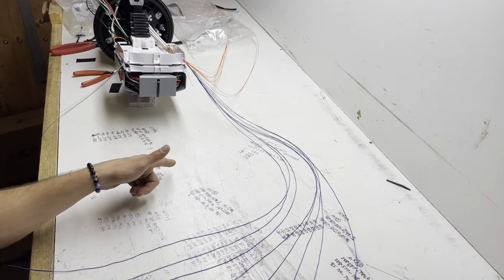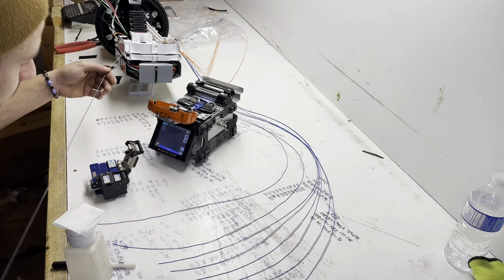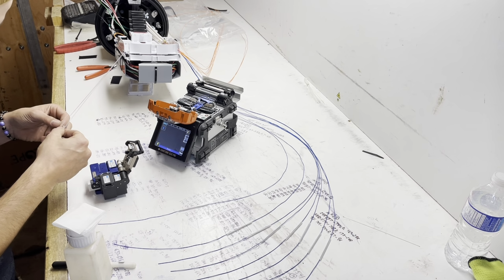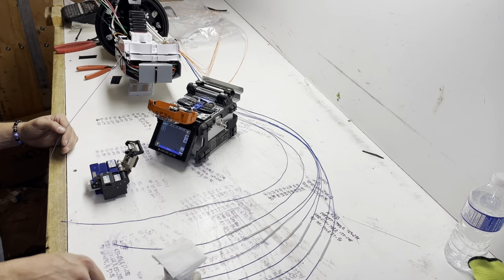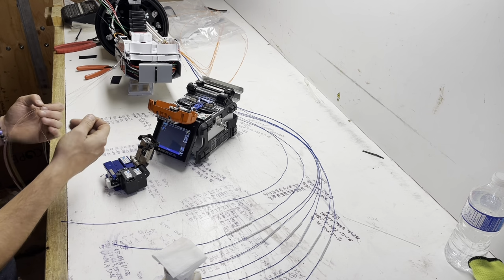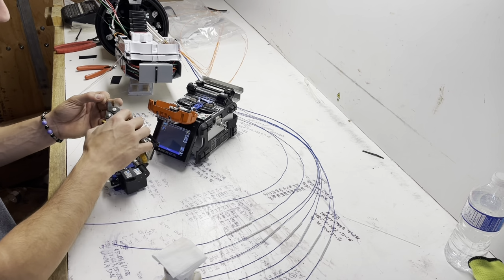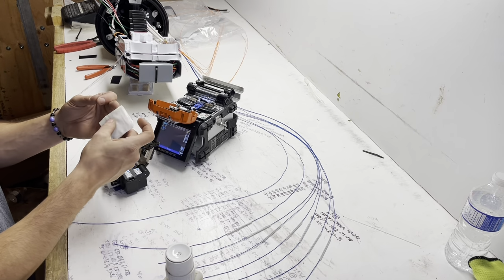Splicer going. I'll grab that right quick. All right, we got the splicing machine all set up. We already arc tested for singles. And yeah, let's get these eight drop lines spliced right quick. So, start off with our blue. Remember, everything's already cut to length and tray measured nicely so that when we do splice, we'll go to put it away, it'll go away nicely.